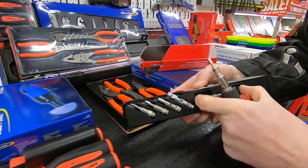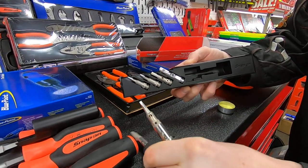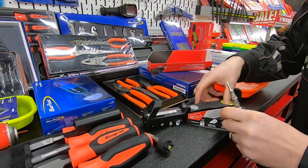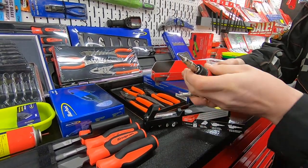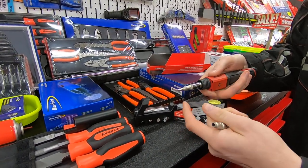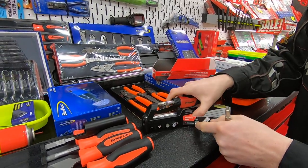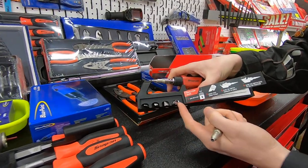You'll notice that there's also a second carrier here for tips, and that's currently fitted with the hot knife. I'll just drop that tray back in there. This is a nice feature of this new iron — normally when you're soldering you may need two tips: one for heat shrink and one for soldering, or you may need one as a hot knife and one for plastic welding.